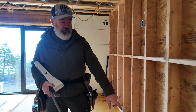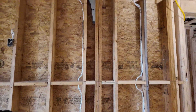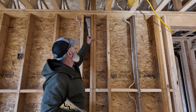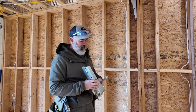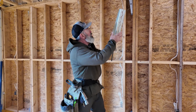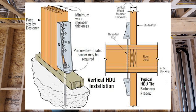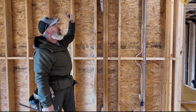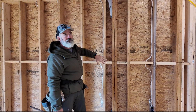We've got our HDU down into the floor — that goes right into the concrete footing. Up above here, you can see we've got another HDU. The threaded rod anchors the one above, goes up above, flips down, and ties together. By the time the OSB or plywood goes on this side of the wall and goes on the side of the wall above, it creates basically a monolithic wall that's tied together all the way into the footing.